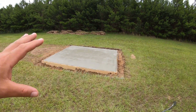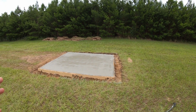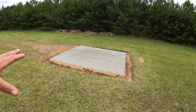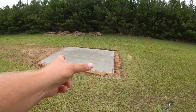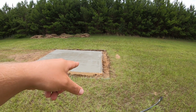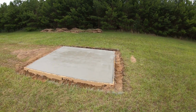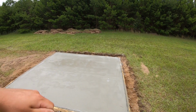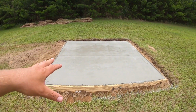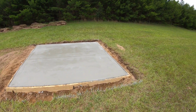But it's curing right now. Just poured it this morning, and I'm just out here kind of wetting it little by little because the sun keeps popping out, really drying it out quick. Overall, like I said, I'm happy with the finish. Once I get big thick walls up on it, you won't see these rough edges. I just didn't have the right tool to do proper edging, and the few little marks out there are just kind of where I was troweling over. And like I said, I didn't get it professional, but for my first time ever doing a slab, I'm very happy with it. Very happy.